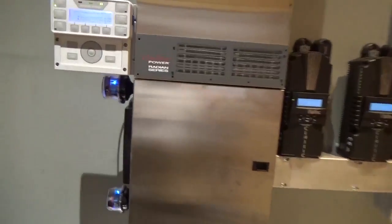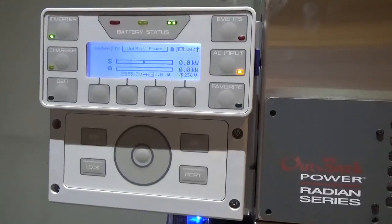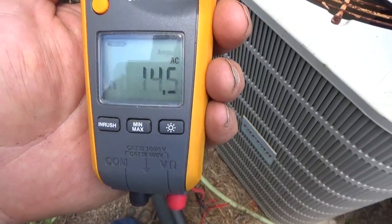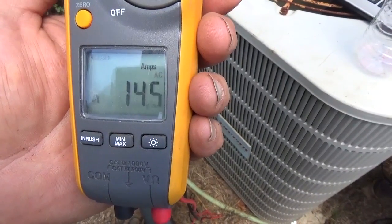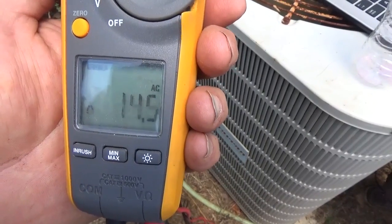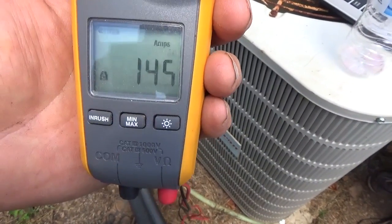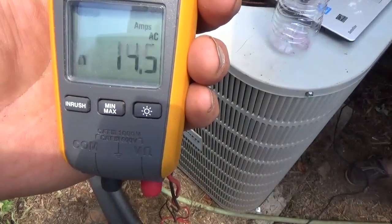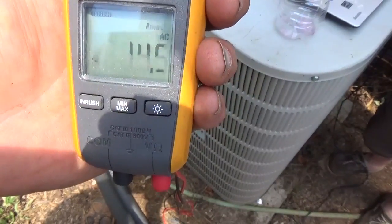Very excited to do this test. We've got our Outback Radian inverter in. I am in off-grid mode — AC input is off, inverter is on — and I'm about to start the Multi Aqua chiller running off the battery bank. I wanted you to see the meter. When we switched from on-grid to off-grid with the Outback Radian, the amperage never changed — it held right at 14.5 amps. Again, this is a five-ton unit in 95-degree ambient making 46-degree water and keeping my house at 74 degrees. I'm running 5,200 watts with no surge — this is what allows us to do this on solar.